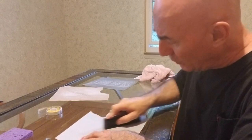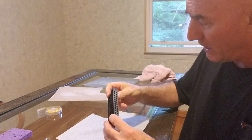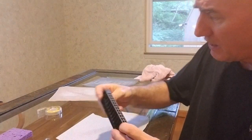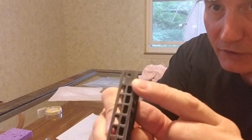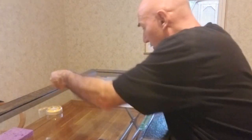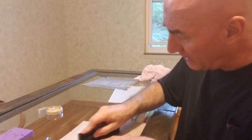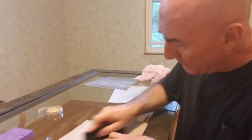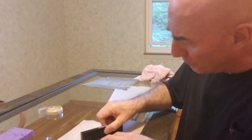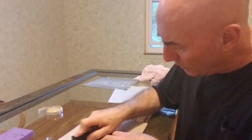I'm looking at the pattern in the sandpaper to see how I'm doing. I can see that all the way at this end, there are some parts that aren't sanding yet. So I'm going to back up and go back to the more aggressive sandpaper until I get the whole thing sanding. That's why you inspect — you have to use your brain, look at things, and decide: are they okay or not?